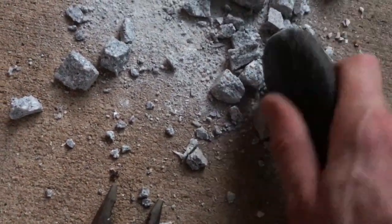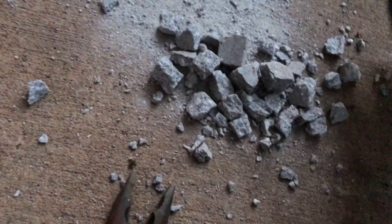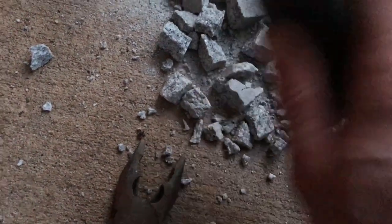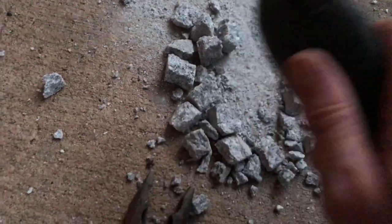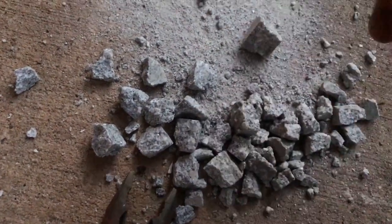After breaking it into dust, I wanted to make it even finer for polishing. What I did is called calcining the sand, which the ancients reference as well. If you want to make a really good abrasive — especially from what Pliny calls Indian sand — it needs to be calcined by burning.